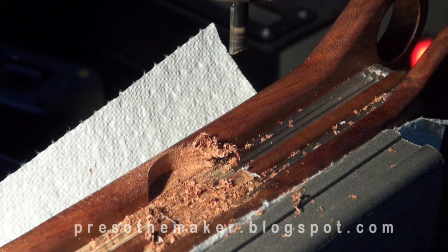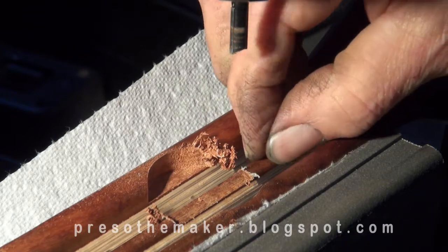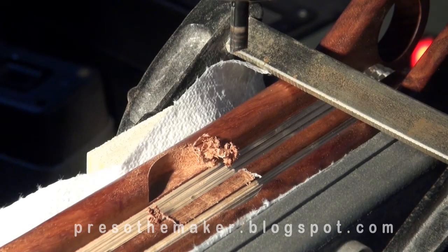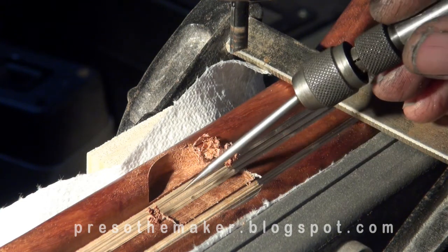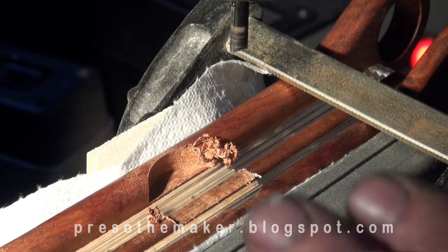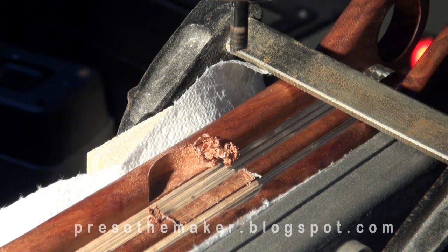That's not finished. I was getting a bit nervous about the vibration that I could hear in the center here. So what I'm going to do is put a clamp across these surfaces at the top to try and pull them together, and I'll run the program again. But stand by. Right, so I just put an F clamp on there to try and compress these layers a bit more. Inside I've got a block of wood which is sort of supporting these acrylic layers and the center plate, just because I was worried about the vibration. So I'll run this program again and then we'll catch up when it's just about to finish up.